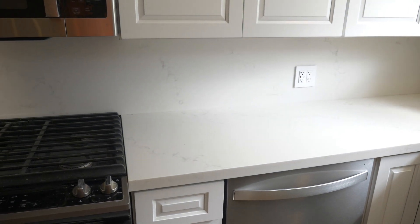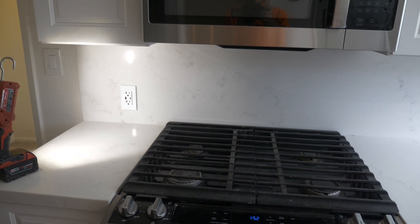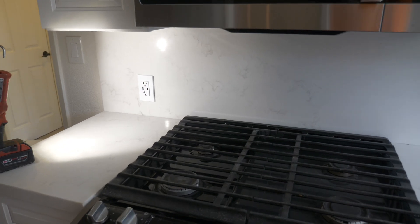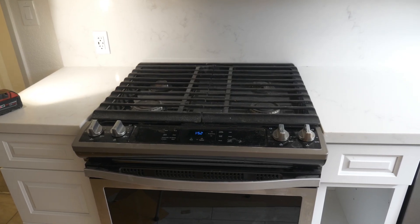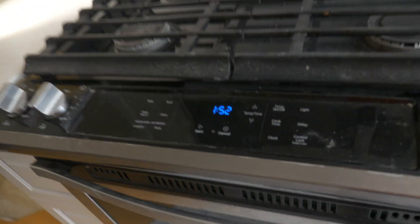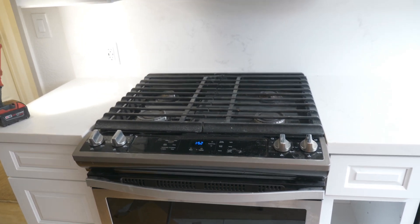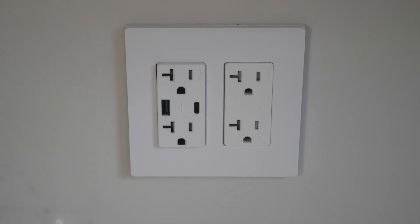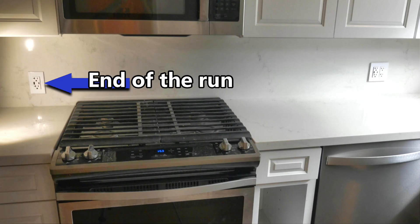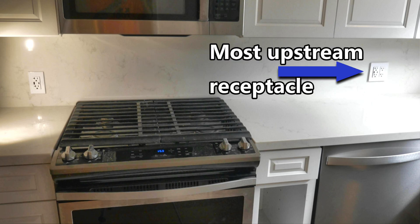When you turn off the circuit breaker, you find that out by figuring out which ones are off. This particular circuit includes this end-of-the-run receptacle, a receptacle behind the stove to run the little lights and timers — it's a gas stove with a low amperage draw. And then there's a box that includes two receptacles. For troubleshooting purposes, I would first check the end-of-the-run box, then the middle-of-the-run box behind the stove, and then the two-receptacle box — one, two, three, just like that.